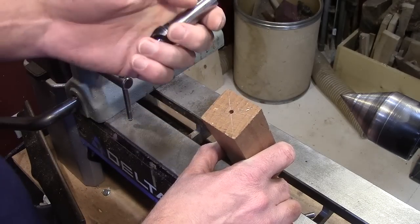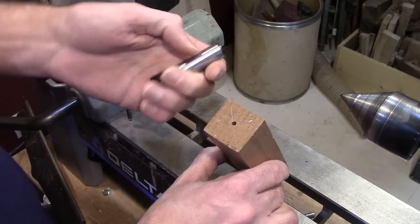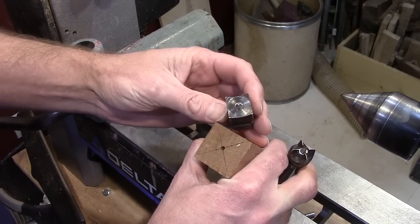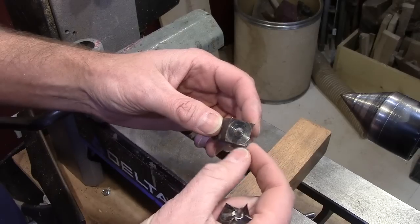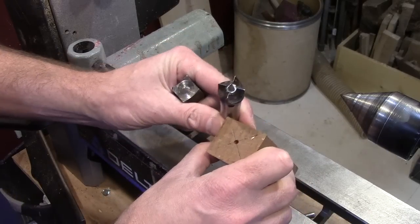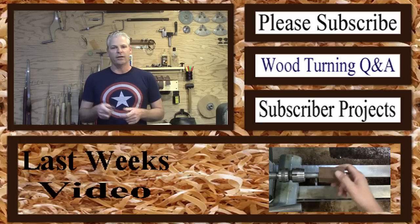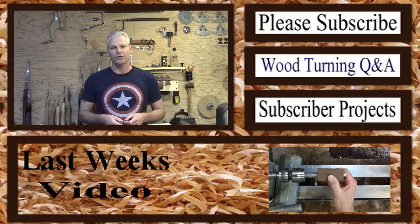With the relief cuts, I generally don't bother — I just put a small hole in it for the tip and that's it. I use this one right here; I do have another one that goes into my Nova Chuck but I don't like it — it's pretty much round with little smooth tips so it loosens up on you. I'd recommend one like this one instead. On wet wood, just keep tightening up the tailstock and checking it every once in a while. Thanks for watching and don't forget to subscribe.